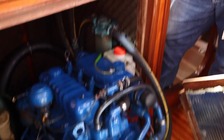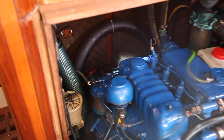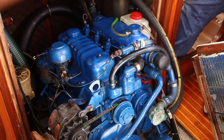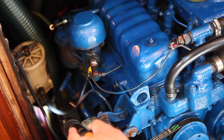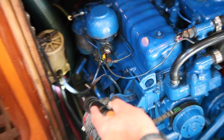On a weekly basis, you would also check your transmission fluid. You've got to lean way over the back of the engine — the dipstick and fill cap are one and the same on this engine. This engine uses automatic transmission fluid; different engines may use the same oil as the engine. You should also check periodically — once a week — your fuel water separator, to see if you have any water condensation in there.